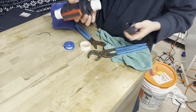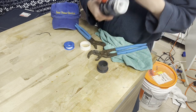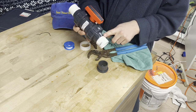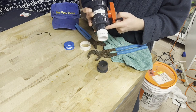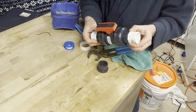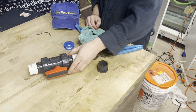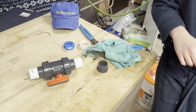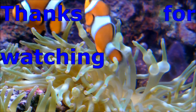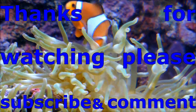I couldn't get these in blue or gray — I think they had them in schedule 40 but they were about five times the price, which didn't make sense for me. I put a little extra Teflon tape on this one, which is why I couldn't seat it all the way in. Not all of these are made exactly alike — you won't always get it fully seated, but that doesn't necessarily mean it's going to leak. Make sure you leak test it regardless. If you have any questions or comments, post them below. Please subscribe to my channel and join me on my review adventures as I try to help out the community.